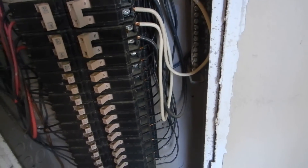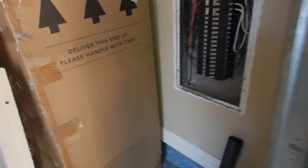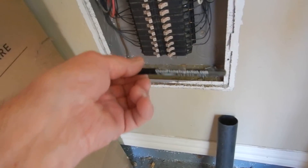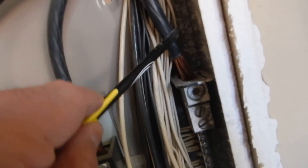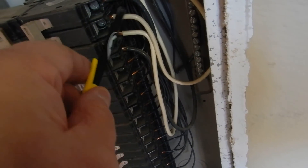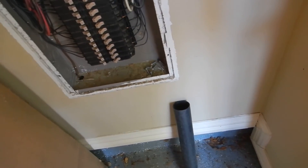So in summary — 200 amp copper service. We learned the grounding rod wasn't properly buried; there's no slip joint on the conduit; hand labeling on the breaker box was not duplicated; the electric load center cover does not fit flush; the cabinet was screwed rather than nailed in; we have bundling; the neutral is not wrapped with white tape; no neoprene covers on L1/L2; neutrals are double-lugged; white hots are not wrapped with black tape. Nails have much more shear strength — and it's in the instructions.